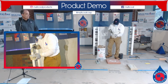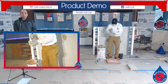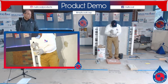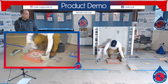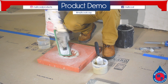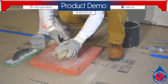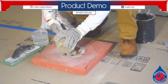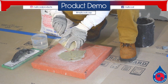Again, it has a rust inhibitor inside, so if you're doing a repair inside of a pool or you have rebar exposed, it helps protect from rusting. Also, on any walkway or sidewalk, it is a great product because it sets up so fast and you're able to start working over it rather quickly. It comes in 65-pound bags, or you can buy it in a 50-pound bucket if it's easier for you to carry that way.